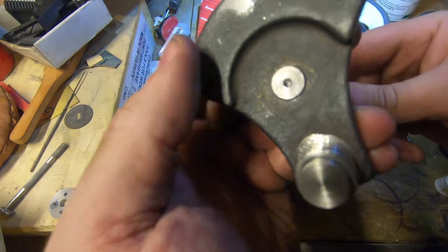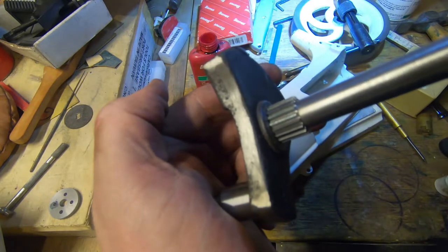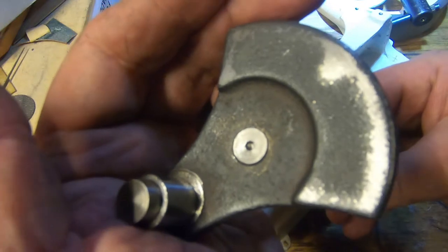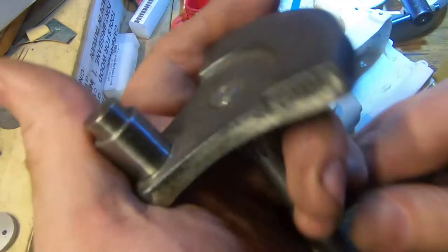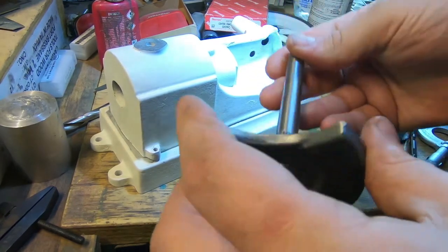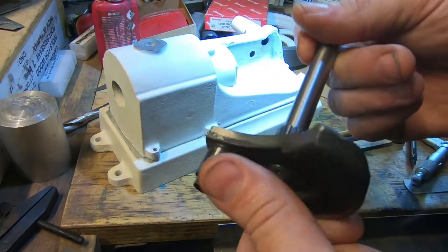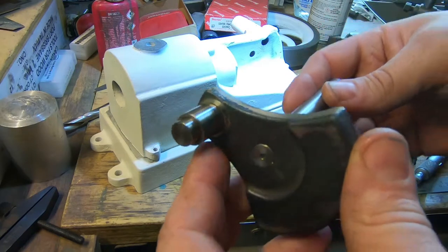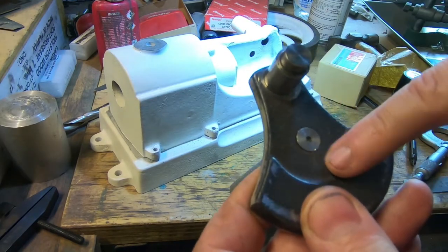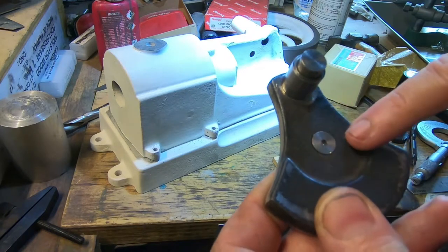It's on. I'm probably more proud of that fit than I am of the gear, to be honest — but it took a bit of getting on. I had to hit it pretty hard, not hard enough to damage anything — I haven't damaged the centre hole. I had to sit it on the back of the vise pretty hard. I found a brass cap to go on here to clear this and stop burring up, and it took probably eight or ten decent hits with a fairly big hammer to drive it home. I don't think it's ever coming off — it's on there for good.